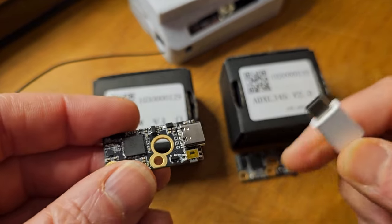Another important thing in the config is the axes_map setting, which tells Klipper what direction the sensor is oriented. They have a three-dimensional sensing system with X, Y, and Z. The standard positioning assumes X, Y, Z, but if your sensor is mounted at an angle or rotated, you need to map the sensor's axes to the printer's axes. On the sensor board itself, you can see little arrows showing the X and Y directions, and a circle in the middle indicating Z pointing up toward you.